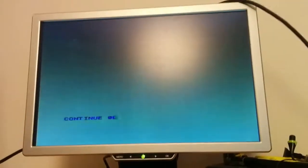Paper? No. Delete. Paper? Symbol shift? You can't actually type keywords on this, you know. Continue is not the one I was looking for. That's not Spectrum noise you're seeing when the screen goes glitchy like that. It's the upscaler failing to sync on to the signal. And in fact, you see that white bar that's appearing? This explains what I was seeing in the oscilloscope. I was seeing sequences of strong signal with a band on one side, and I was wondering whether that was frames or scan lines. Well, that band is that white stripe, so I was obviously seeing scan lines.